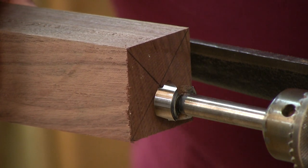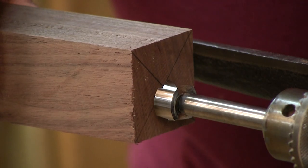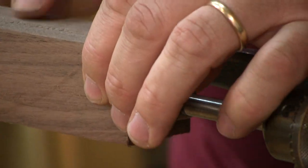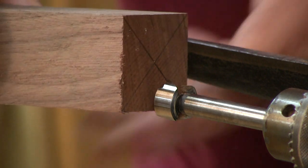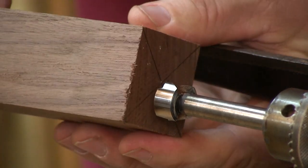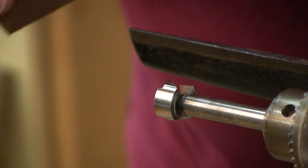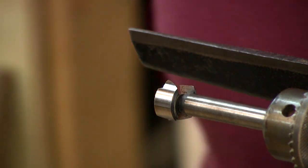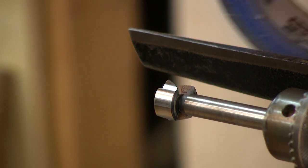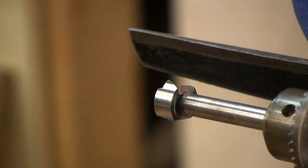Tim, what I've done now is I've set up a chuck into the headstock of my lathe, and I've put in a 3/4 inch bit. And we're gonna take our tailstock and use that to feed our blank for our candlestick right in there. We need to drill the hole to accept the candle. And the first thing we need to do is use a little bit of tape. And we need to drill our hole at about 7/8 of an inch deep.